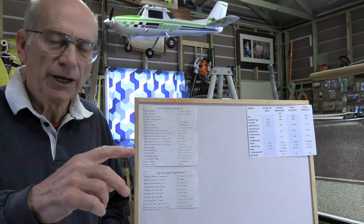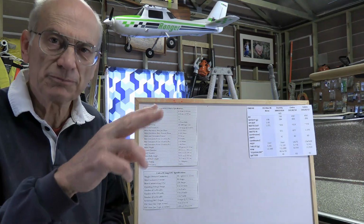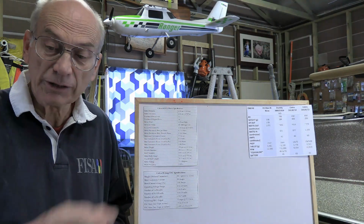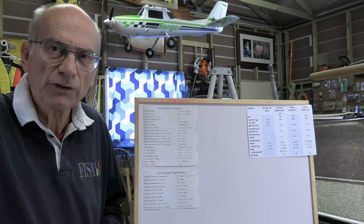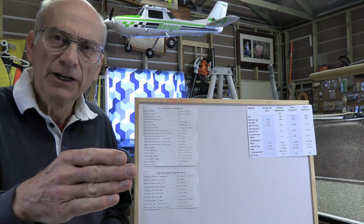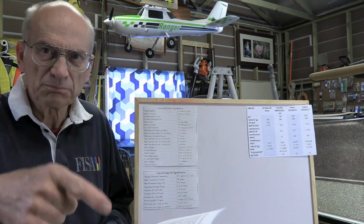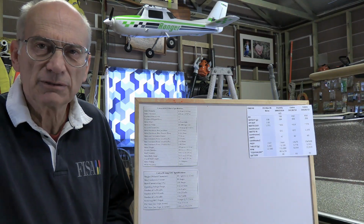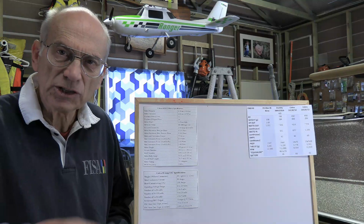And so with the motor, the ESC is constantly providing power to two of the three windings, and of course it could be multiples of those going around, but two at a time going around the whole thing. But it's constantly switching it on and off. And it does a lot more of that switching on and off when you're at partial power, because it's actually a whole bunch of little pulses of power all together to reduce the power as compared to one long surge of power for each cycle that the thing goes through. And in order to keep the thing from sparking and creating abnormal voltages that could really cause damage to the motor, they have to dump that power each time it's turned off.